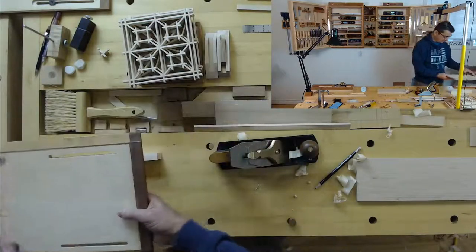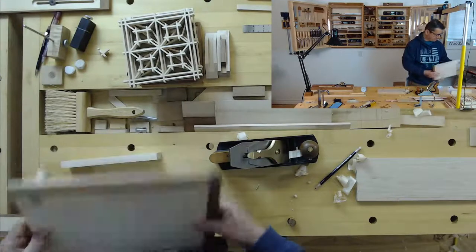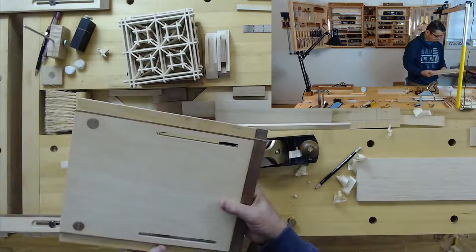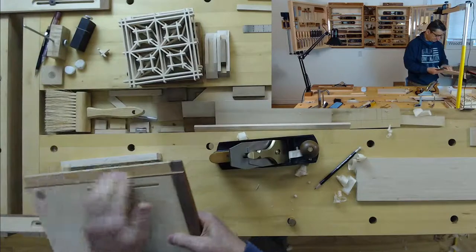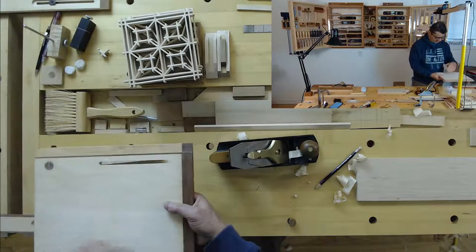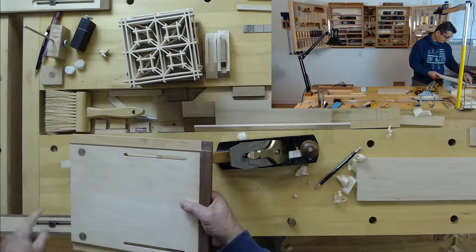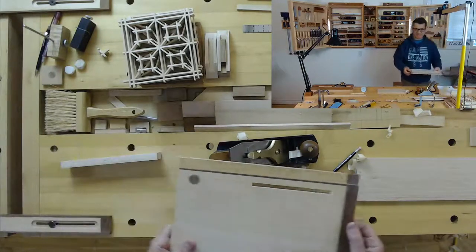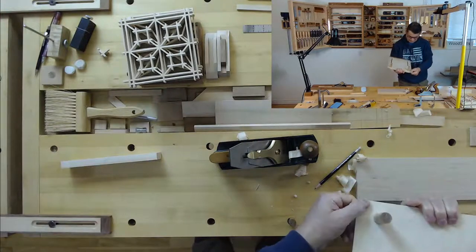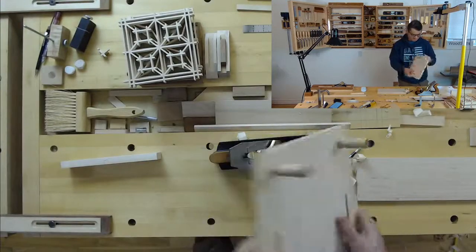It has two sliding components. It's one large assembly, so you could use it for wider boards, and it locks in with two dowels and the vise chop. So it works similarly, except that it's much wider, and because it's wider, I set it up with two slots for the bolts that hold it down. So that's pretty cool. I haven't used this one so long, but I even have Mylar tape underneath to keep it sliding well. This works really, really well.